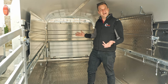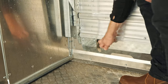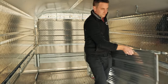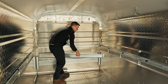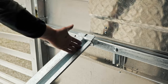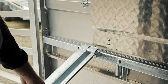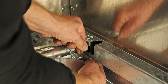Now for a demonstration of how the decks go down and back up again. First, pull your bolts out and release the clip, slide that out, and take it to the back of the trailer. You can then gain access to the bars behind — pull out the slot and then just literally put them down and lean them up on the side for now. The trough goes facing the correct way as the deck comes down so it has somewhere to sit — make sure that one goes the right way round. Clip your clips all back in again as you won't need them until you fold the ramps back up, and they're out of the way for any livestock coming in.